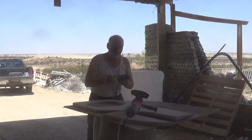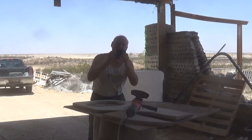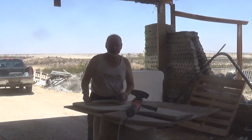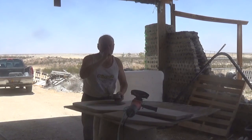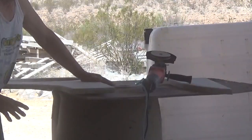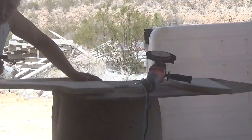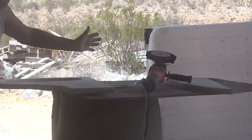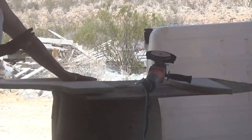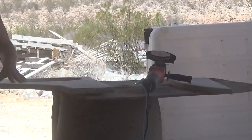Then it doubles from there. So you've got 50, 100, 200, 400, 800, 1600, 3000, 6000. 6000 will give me pretty close to a mirror finish. It is, after all, essentially an outhouse at a campground. So I'm going to get started with that — I'll let you see me start, but I'm going to move the camera back a bit because I don't want to splatter it. I've pulled the edge out because that's all we're working on right now. I've got a 55-gallon drum with a couple of cinder blocks in it, a piece of plywood, and this. Let me turn the water on and we'll get started.